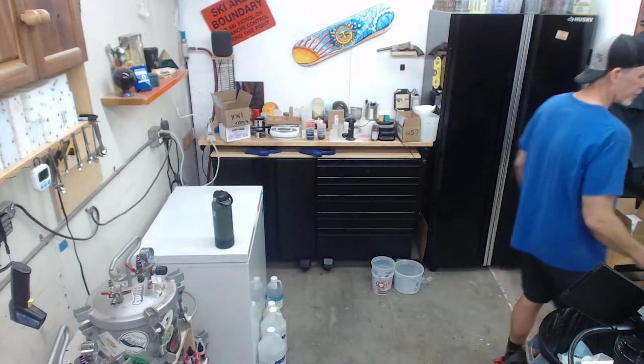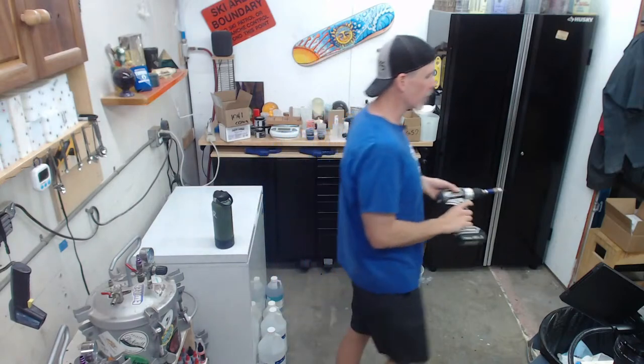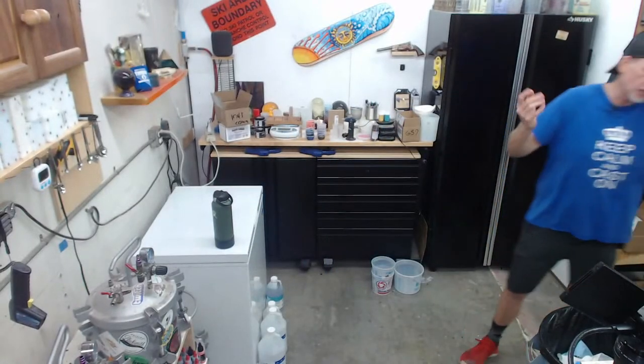That's one thing that I mentioned also. I think you could get away with using a drill press. I think a lathe is better, and if you have a lathe, I would use a lathe. But really, worst case scenario, I would probably recommend using a corded drill. Most of your drills will fit that half inch shank. You could mount your drill, plug it in, and turn it on. Most of the plug-in ones have a lock. You could probably get away with just sanding it with a hand drill, honestly. So lots of different ways you can do it.